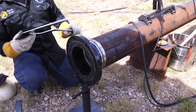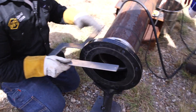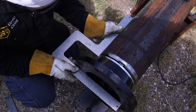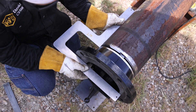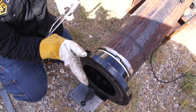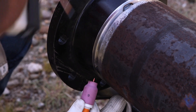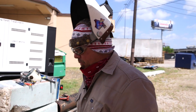Now I'm gonna square this on the side — make sure that our flange is nice and square with our pipe. It looks pretty good. It's kind of hard to see, but I see it's a little bit just touching this side first. So I'm gonna go ahead and have Andy tack this side, that'll pull it a little bit that way. All right Andy, you got it all fit up, all tacked up, ready to go. I'm good, man. Thanks, I appreciate it.